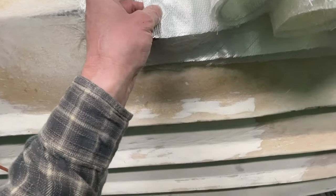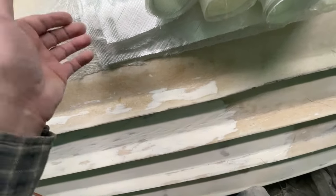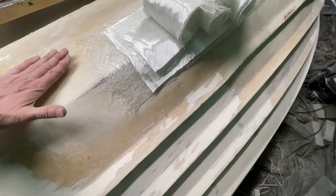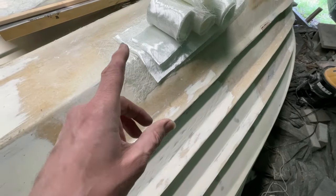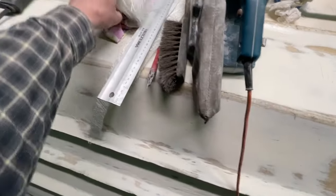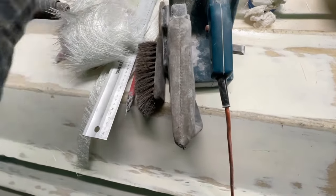And between the 2 layers I have a thin layer of fiberglass mat again, and a woven again, and then I'll build up with pieces of the 600 grams again to get the bottom part, because it's chamfered from here down to the center a lot. I have totally 8 layers. 1, 2, 3, 4, 5, 6. Sorry, it's running. 7, 8. 8 layers. Fiberglass coming on.